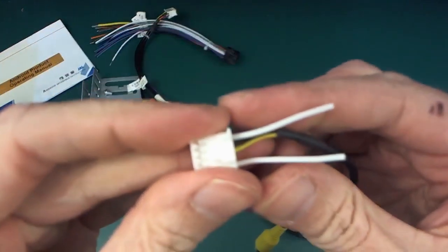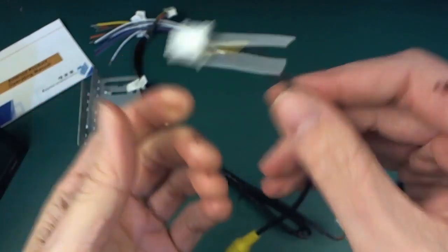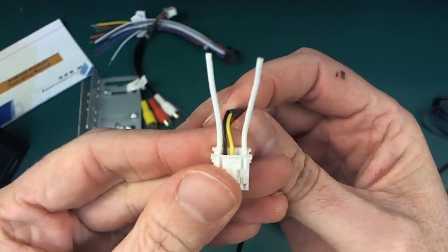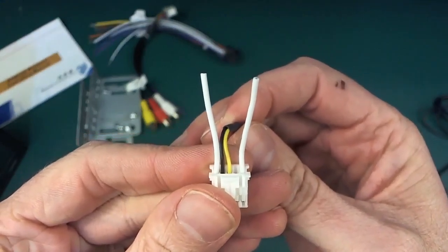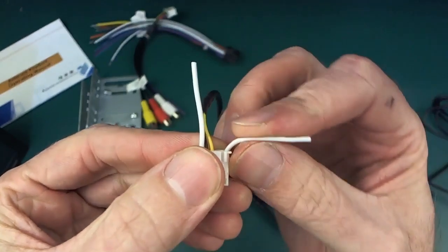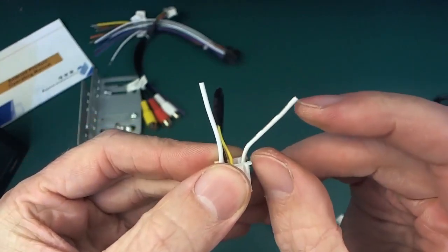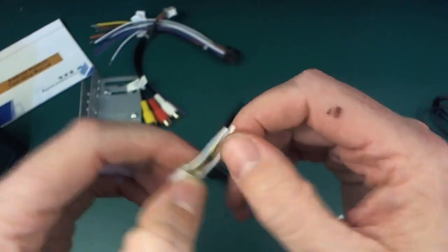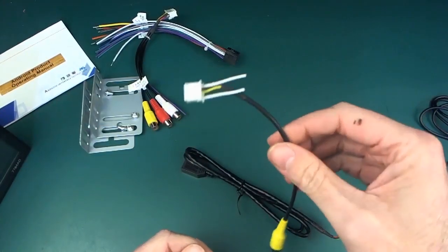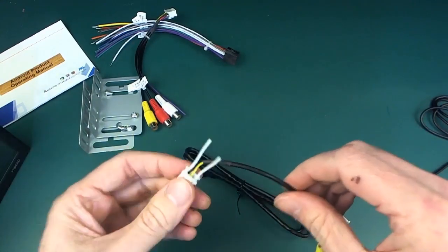Then there's a couple of little white wires on here, which at first I thought were for nothing, and I just sort of ignored them. However, viewers of my channel may have already figured out what these two little wires are for. They're not for nothing. Perhaps if I put them at 90 degrees to each other like that, and I pointed out that they are roughly 30 millimeters long. Okay, now you get it, don't you? Well, I initially did not get it, and I couldn't figure out why I was having so much difficulty getting a Wi-Fi signal. It was very sketchy.